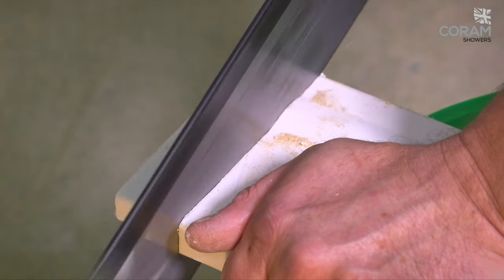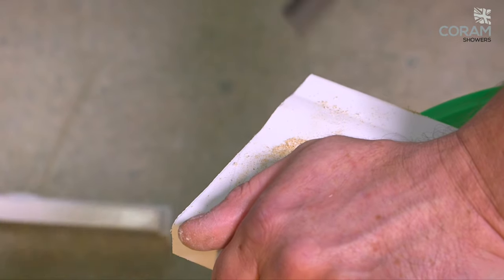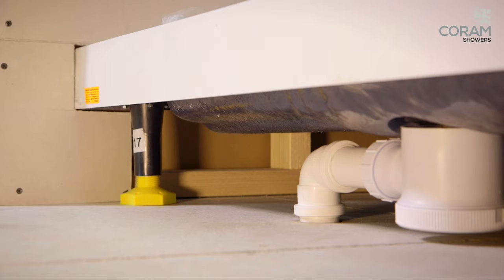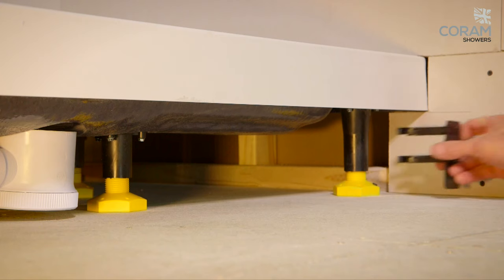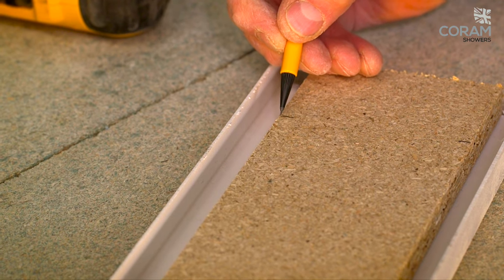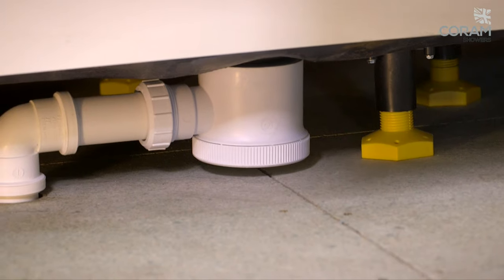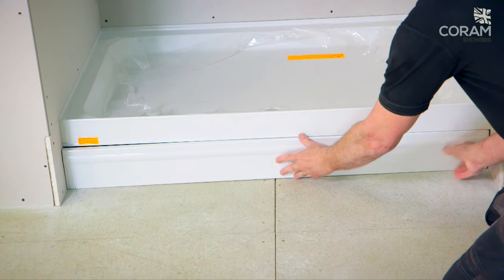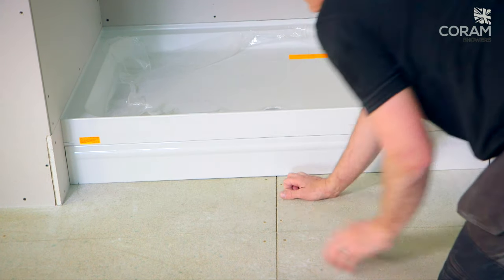You will need to trim the rigid side panels on the ends so they fit flush with the walls. The panels are attached to the tray with push-on spring clips. To ensure you've fixed the clips into the correct position, first attach them to the legs and then align the panels. Mark the centre of each clip and fix them using the screws provided. If fitting a corner installation, you will also need to stagger the position of the clips to the corner leg to allow for the attachment of both panels.